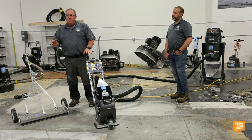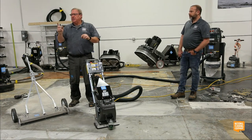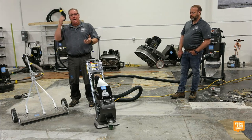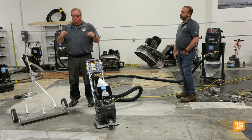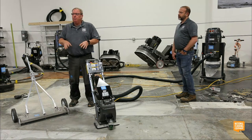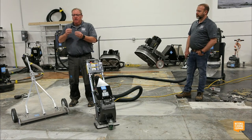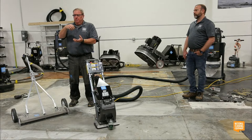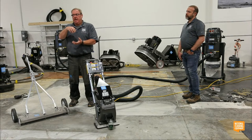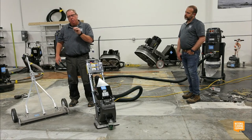Why is it not set at 19? Because the hoppers are square and you're going to get some dust in the corners. I don't know why we don't make a round hopper. I'm not an engineer. I don't understand physics, but that dust is actually heavier than the shot and it will collect up, as with all blasters of every size. It's like taking a Coke bottle: how many marbles can you put in it compared to how much sand? Lots of sand. So it'll actually increase your amp draw. So I keep my valve open where it's only pulling about 16 or 17.